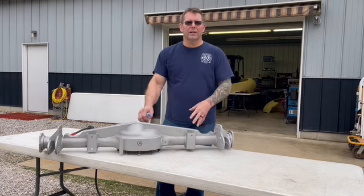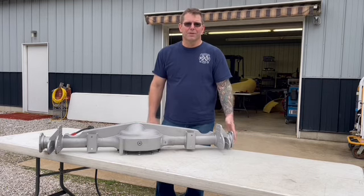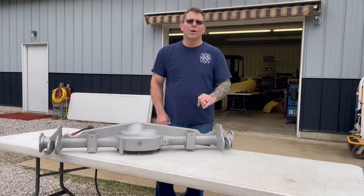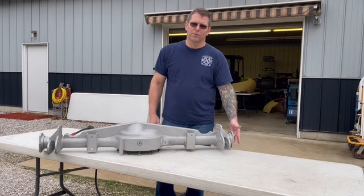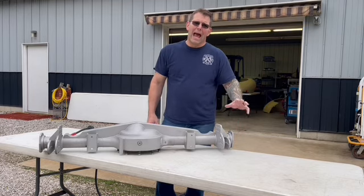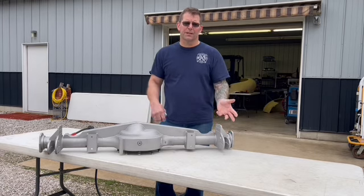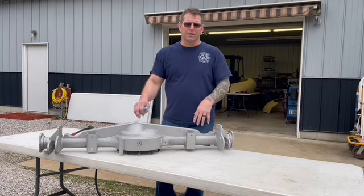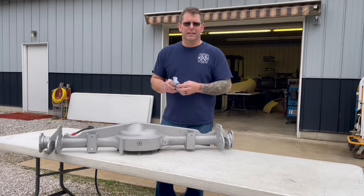They're gonna do a little bit of cleanup on it themselves. I'm sure they'll just check and make sure that their stuff's gonna stick. So this is ready to go to the powder coater. Once it's back from powder coating, we're gonna assemble it. We're gonna clean it really, really well. We'll actually clean it like a gun barrel with a rag and then clean around the inside. We did a pretty good job of cleaning it before we sent it to the sandblaster, because any of that oil that sits inside that housing is gonna grab media. So you wanna make sure it's kind of clean.